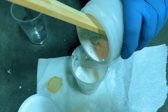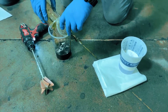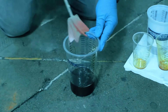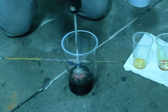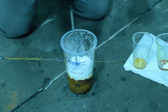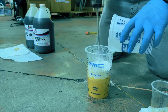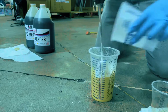If you need a less thick, more liquid-like consistency, you can use less than the 4 parts of C. For best mixing results, gradually pour in the C-Blend rather than dumping it in all at once. You really want to make sure everything is mixed well, so be sure to scrape the sides of the container and get all of that C-powder mixed into the A and the B.